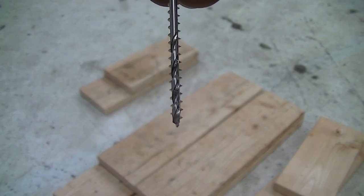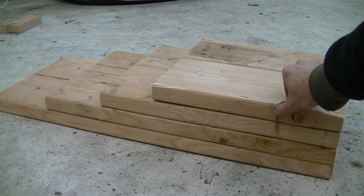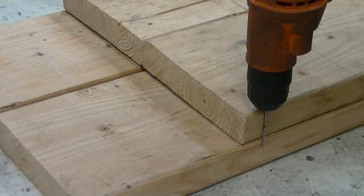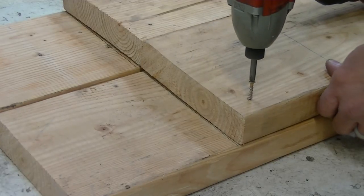As you can see, two-and-a-half-inch screws go into the second board pretty far. Make sure the drill bit is long enough to go through one board well into the second one. You want to use flat-headed screws so that the next board can lay flat on top of them.